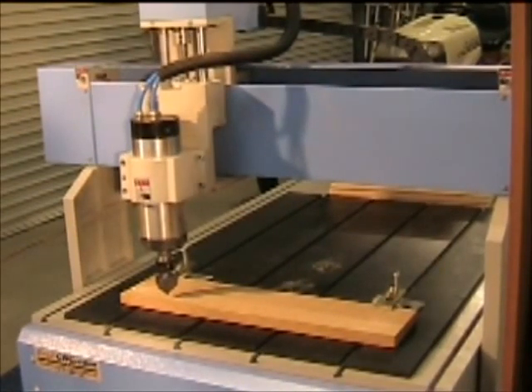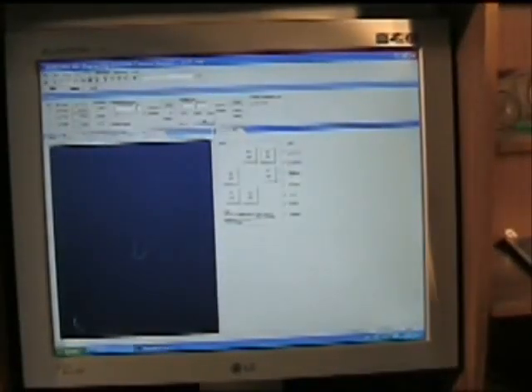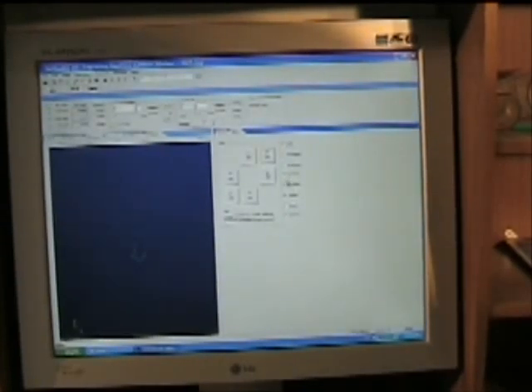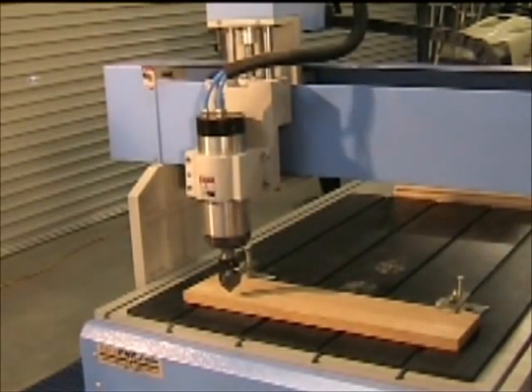I shall move the Z-axis up one millimeter — that's one mil, two mil. And half a millimeter, and 0.1 of a millimeter — a very small amount. Just go back to the machine. You can hardly see it move. If you notice, the Z drive axis at the top is just moving. You might be able to see the drive lock nuts coming around.